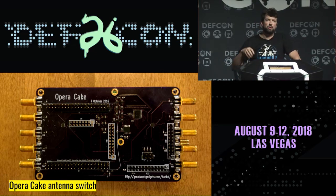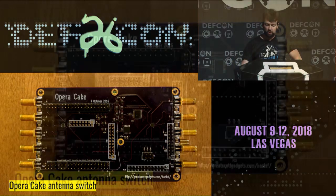And in doing so, what they're looking for is our transmission, and they're looking for a phase shift as they switch antennas. And so if we're able to somehow inject a phase shift, then that will be a phase shift that they don't expect and therefore can't compensate for if it's, for example, pseudo-random.